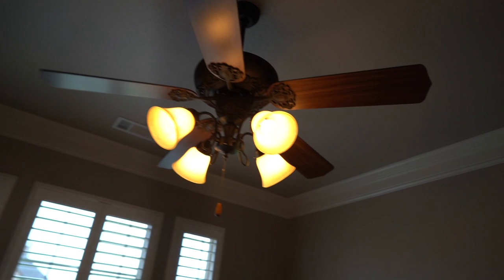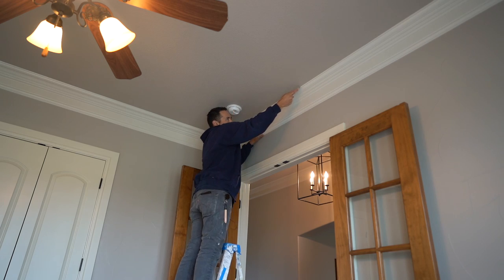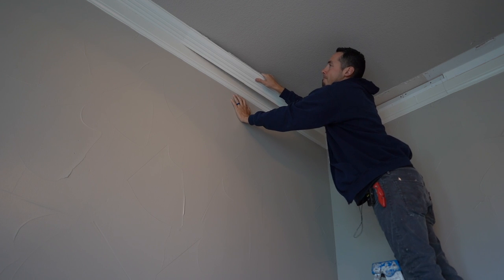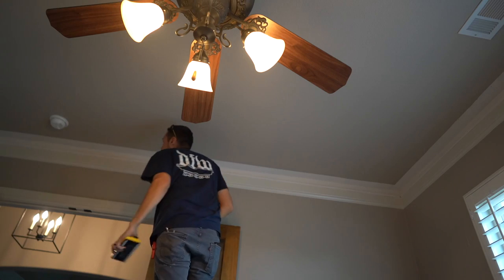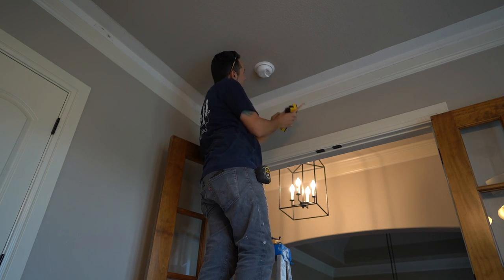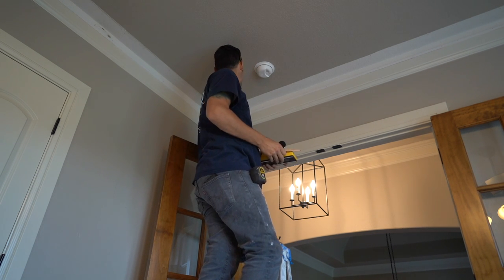Here's the room we're going to be working on for the next two days. We'll take that ceiling fan out. As you can see, it has a two-piece crown buildup already. We'll pop that first piece off — the bottom piece is a base — do our thing to the ceiling, and put a new piece of crown that's the exact same match back on. It'll come down about three-quarters more. We're not even going to bother removing that base. We usually just cut the wires and shove them back up.